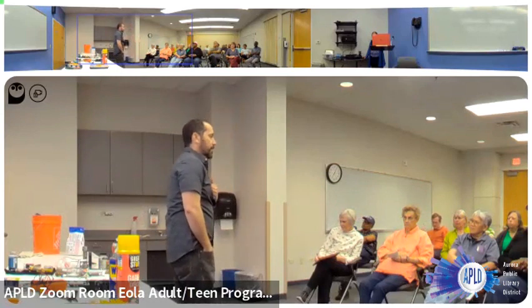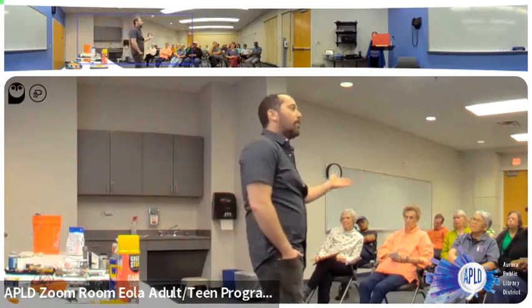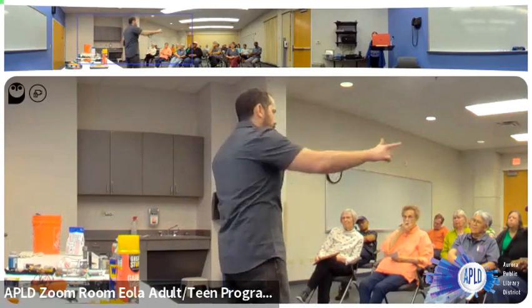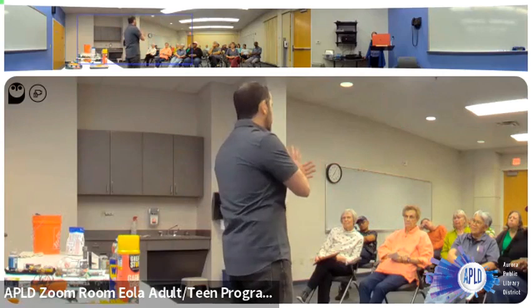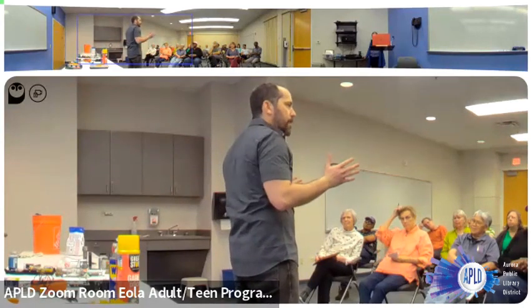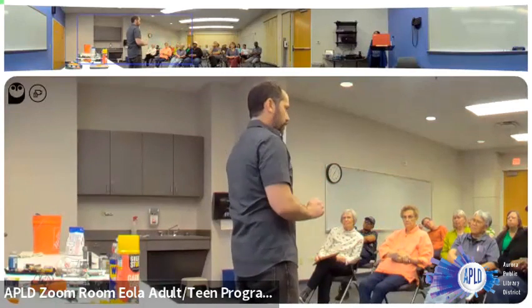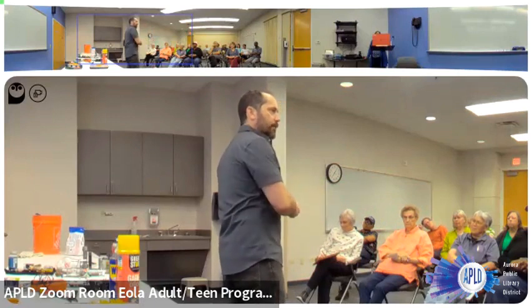Usually what I like to do in that situation is put some decorative trim on the wall anyways. Because no matter what you do, the drywall is going to dent, right? You put a 2x8 screwed to the studs with giant lag bolts, oh, it's not going anywhere. But the drywall is still going to get dinged up all the time. So take a nice piece of maple, miter the edges, stain it, glue that to the wall. And then the door can hit the maple, which is nice and hard, and not do the damage.